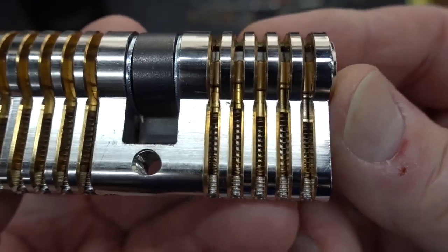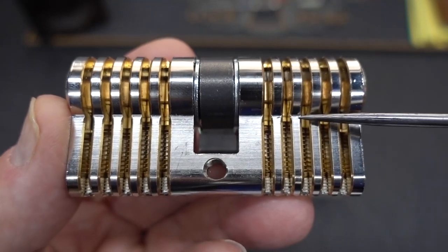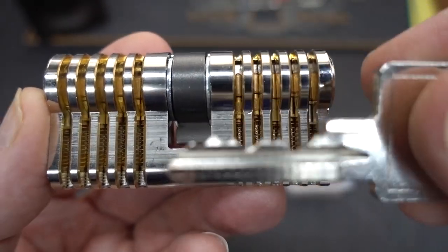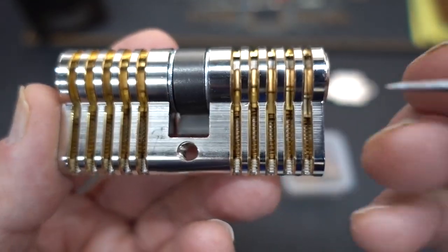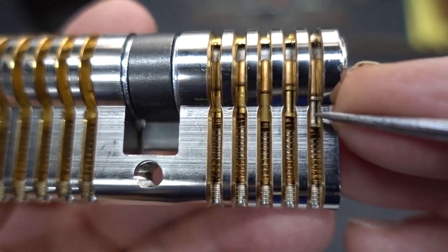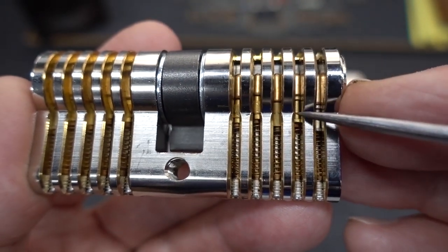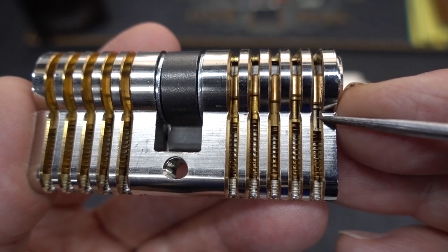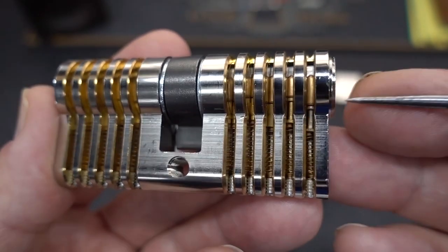When you take a look inside of this, it's a five-pinner, and it's pinned precisely the same on both sides of the cylinder. It does come with a key, and in this case a very challenging key. When you look in here at the driver pins, the first two are pinned up with very long spool pins. The first one's a steel pin, like you would find in a production lock, and that's an anti-drill feature.